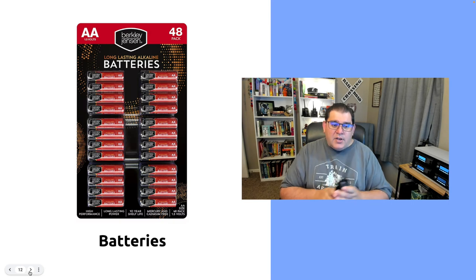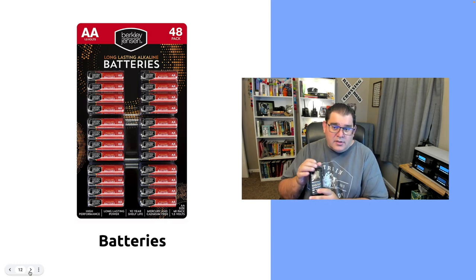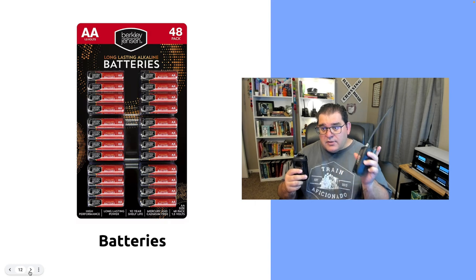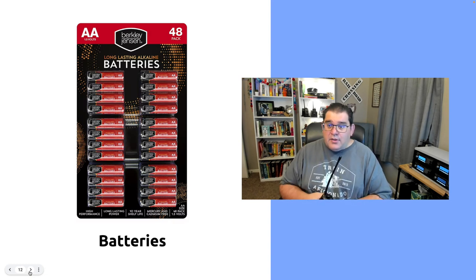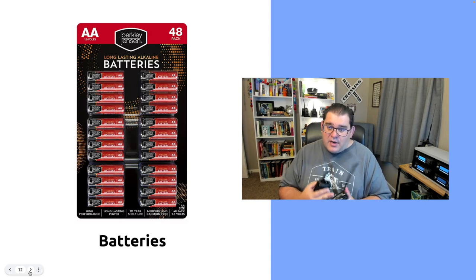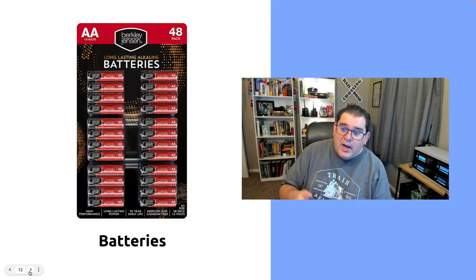As we talked about with the Anytone, you get this on the train. There is a headphone jack on the side of it as well. So battery lasts forever if you know the frequencies. Typically, even if I was traveling on the train, I would bring probably this and my 125 AT. So if I got into a jam and I had to do a search of all 97, turn on bank 1 and bank 2, run through the 97 channels until it stops, and then I'll know, oh, they moved to channel 16. So what I can do on my Anytone is tune this to 16, and then I can keep running this radio as a search for channels, which is really nice. So batteries. As I mentioned, it will work on rechargeable AA batteries as well. You definitely want to carry multiple sets of those in case you're not able to charge it on the train.